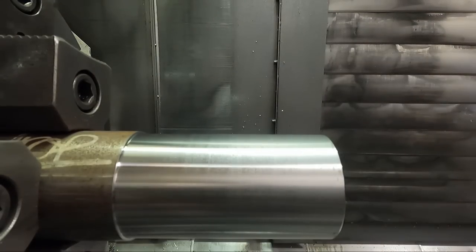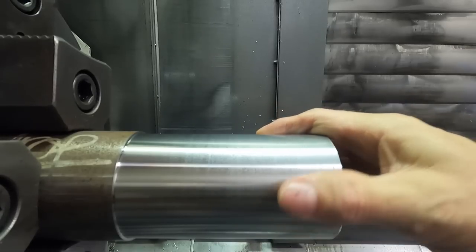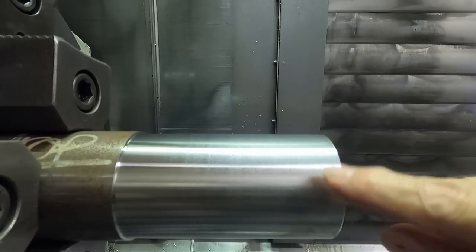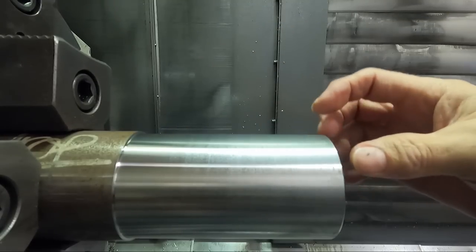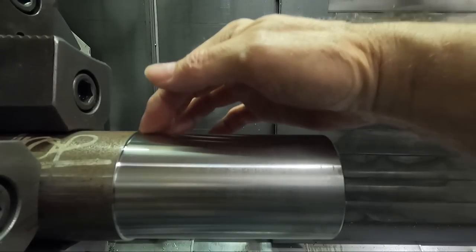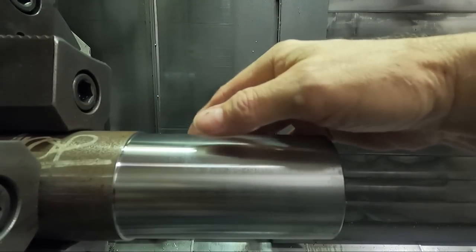All right, that was half the surface footage, 400, and the same depths of cut as it goes down. There's 10 steps, and each depth increases 3/1000ths of an inch. So it's 3/1000ths, 6/1000ths, 9, and so on, all the way up to 30/1000ths depth of cut as it gets down to here to the shoulder.